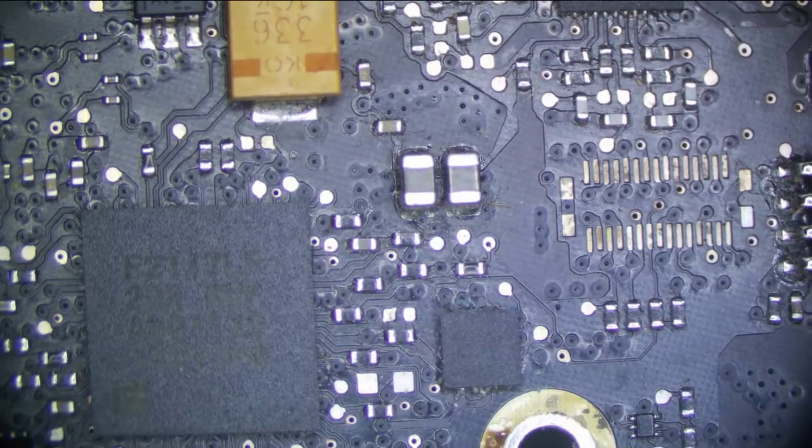Okay, so the first thing we need to check is SMC_RESET_L. This is going to be an 820-2936, old dinosaur 2011, soon to be obsolete piece of junk. It uses a dual core Sandy Bridge CPU. So we're going to open the board view for that, and we're going to look for SMC_RESET_L, which is going to show up on pin 5 of U5010. We're going to measure pin 5 of U5010 and see what we get.